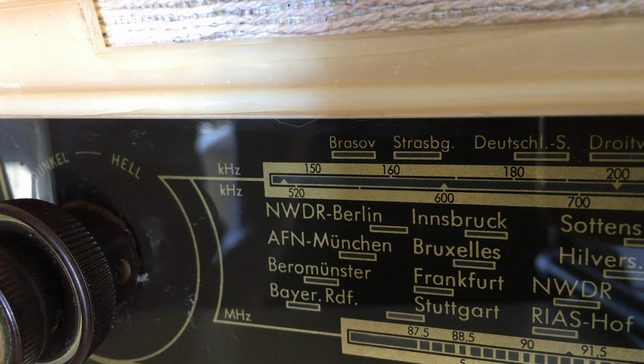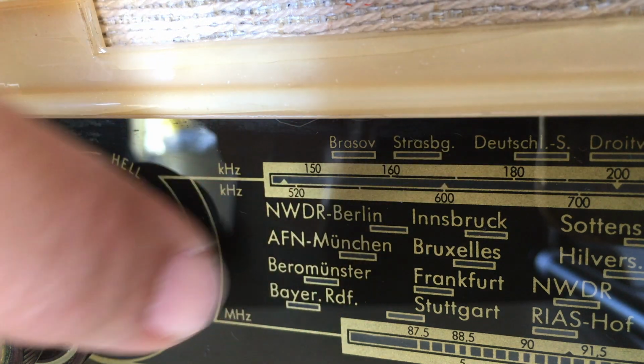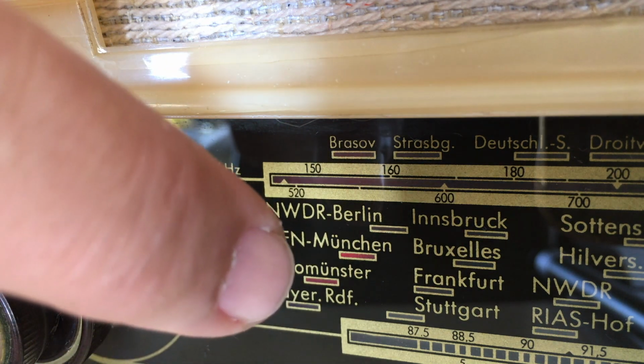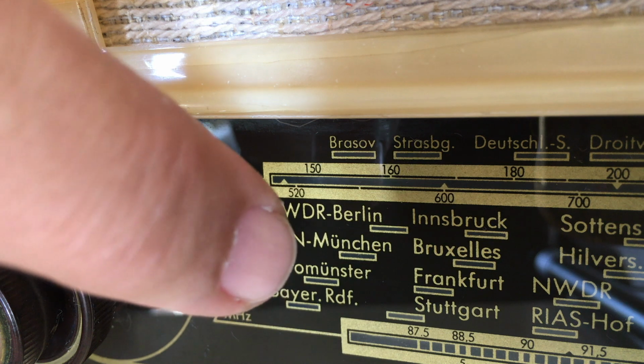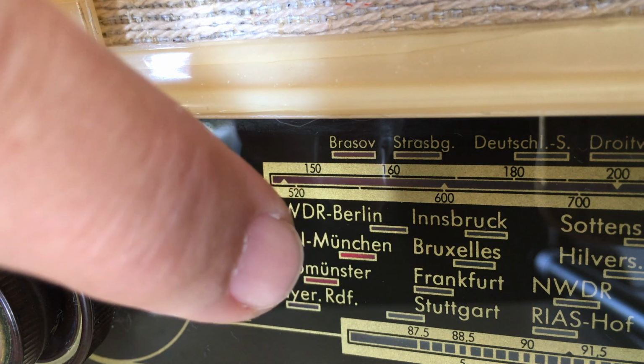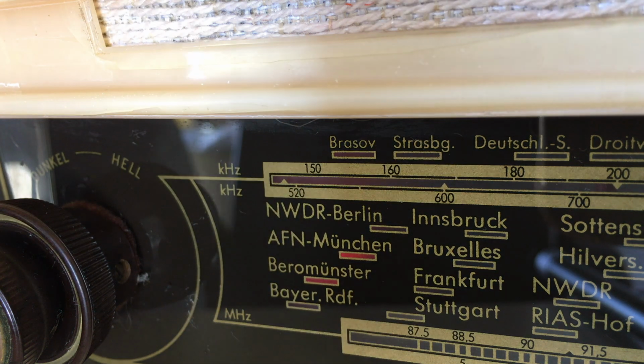I want to show you how that indicator lamp works, the hot chassis indicator. I have purposely put this in the wrong way, and I'm going to switch it on. And if you look down here, you should see the red tint. There we go. See that? Now it's off, now it's on. So we know that that is the wrong way. We've got a hot chassis at the moment. I'm going to flip the plug around, just take it out and back in.